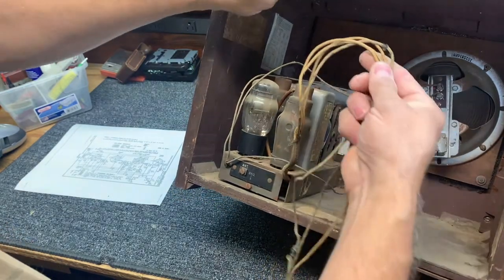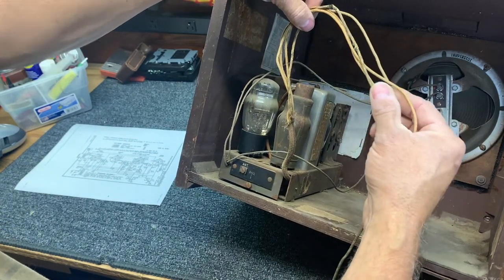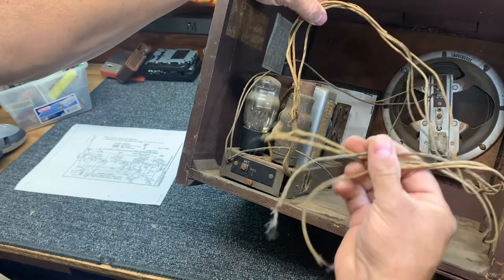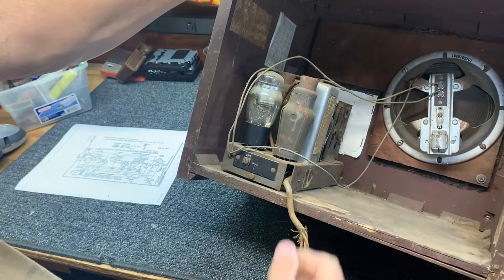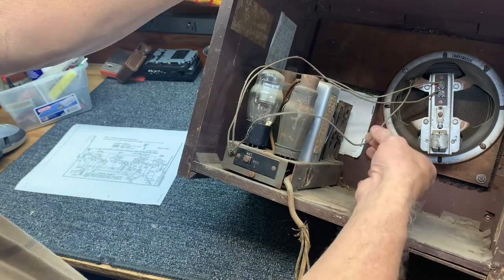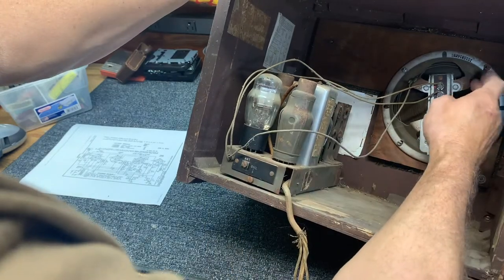So now we've got a set here that's 455. Four tubes right here: we have the oscillator — what they call an oscillator translator — basically an amplifier for the antenna signal coming in. Then they had an intermediate frequency tube, a detector and the first AF stage amplifier, and then they finished with the output tube, the audio output. We have four wires here for the 4.5 volt and the 67 volt battery.